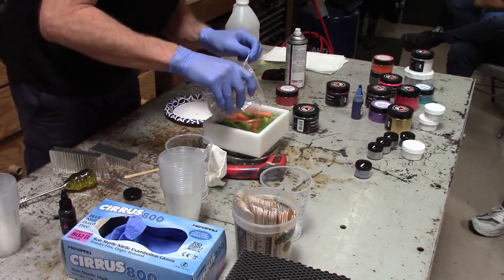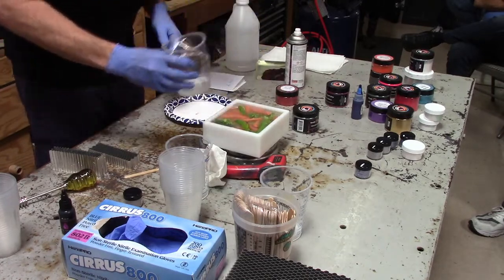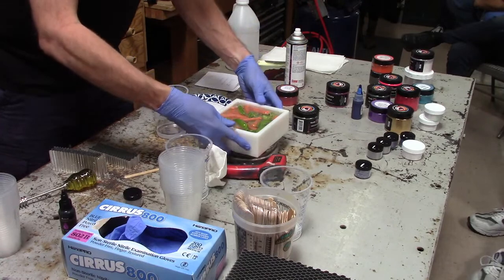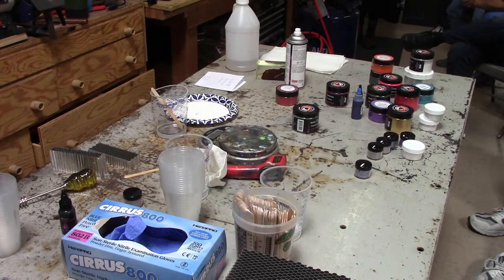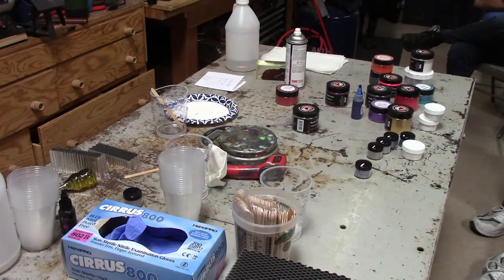Basically it just looks like resin with a lot of vegetables. This resin has about a five to seven minute working time, so I just set it in. We're pressurizing this to get rid of air bubbles. When you mix up the resin you introduce air bubbles into it, and because it sets up so quickly — in about five to seven minutes — the air bubbles wouldn't get out on their own. Pressure is going to collapse them down to the point where they're microscopic, and once it turns solid they're effectively gone.